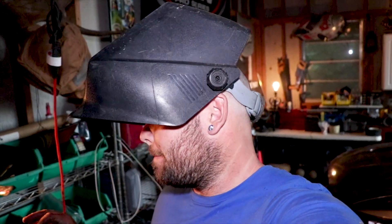The welds look pretty good. I am using flux core, but I've figured out a way to make flux core look actually halfway decent. I just keep that shielding gas up in the nozzle and by doing that it actually looks pretty good all said and done. Polish it up and everything — it's going to be exhaust wrapped anyways, but I still want my welds to look good. They actually do, so let's take a look.